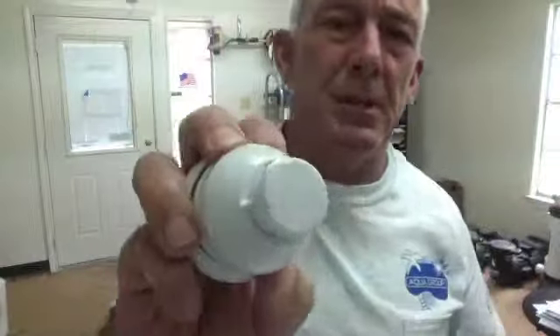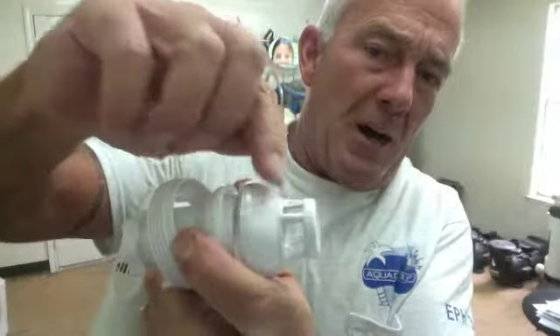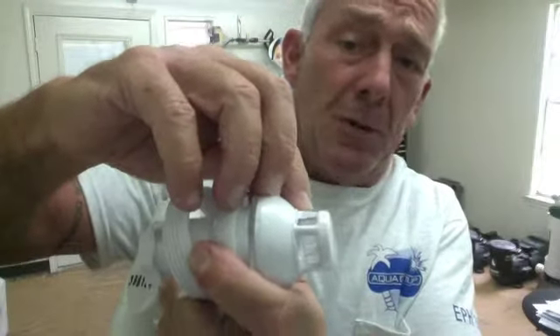This is what it's going to look like when this one comes off. You're going to have this part — that's what those nubs look like, and this will be the back of it. It's turned off right now. Same thing with this: open, close. What I did on mine because I wanted more power — I cut these tabs right off and it really gave me a good amount of power, since this creates back pressure. So same thing: look in there, it's threaded. Take all the jets out, blow it out, make sure your filter is cleaned, blow the lines out, put the jet back in, put the ring in there, get your tool on it or use two screwdrivers.